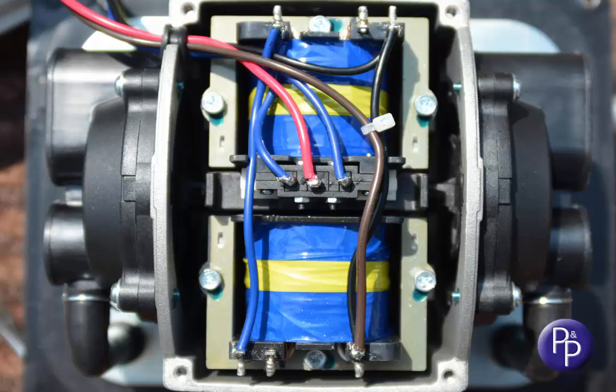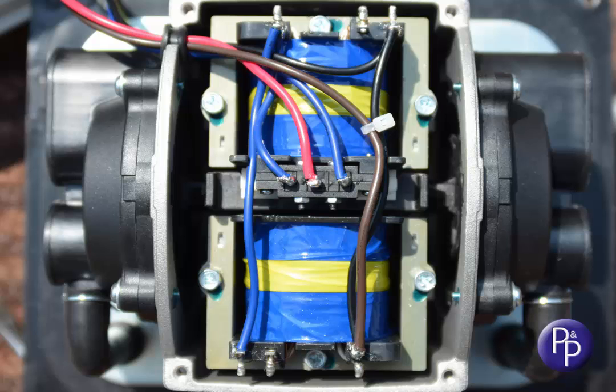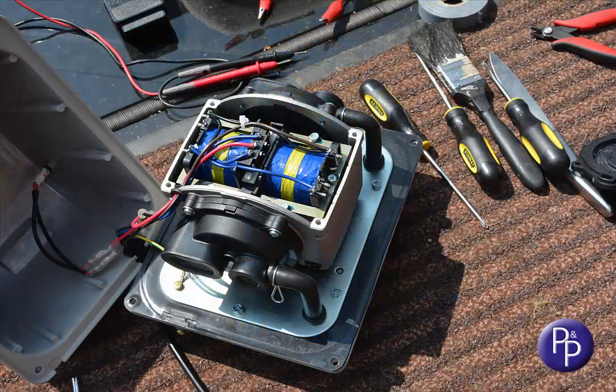The ends of the magnet are attached through the centre of two rubber discs, or diaphragms, and they're contained within two valve boxes or covers. The air is generated in pulses by the two diaphragms, and this air is collected by the valve boxes and pushed down these two pipes into the labyrinth base, and ultimately down to the pipework in the system where the air is required.